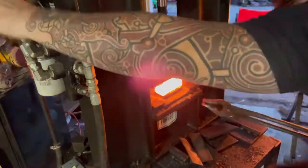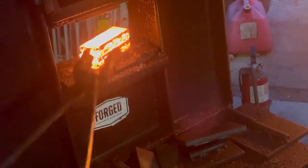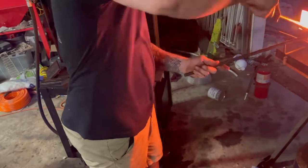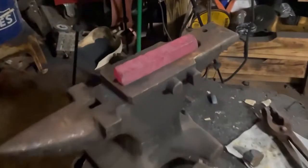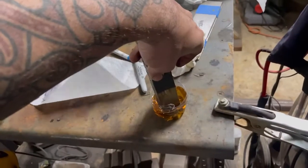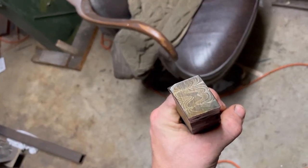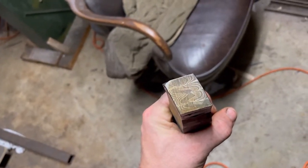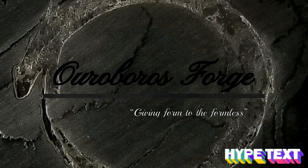Just like the first time, I made the billet around four inches so I could get that nice even press. I'll do this two or three times to ensure the forge weld is good before smashing it long ways, and I'm using a piece of mild steel to control the size of the billet. Here's what we got — look at that, it looks pretty badass. I can't wait to see that flowing down a blade. I just have to decide whether I'm going to do a four-weld or go to a true mosaic. We'll find out on the next episode.